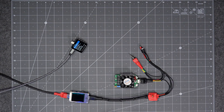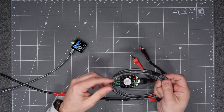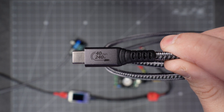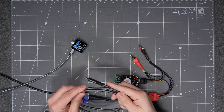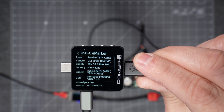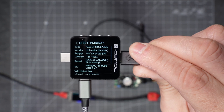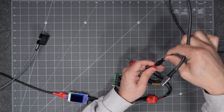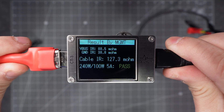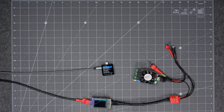Now, Amazon is full of USB Type-C cables manufactured in China from brands not well known here. This one claims it can charge up to 240 watts and supports 40 gigabits per second — Thunderbolt 4 and USB 4 capable. The e-marker chip confirms 240-watt charging, Thunderbolt 4, and USB 4 Gen 3 data transfer. Running the resistance test — it passes, which means this cable is safe to use to charge up to 240 watts.